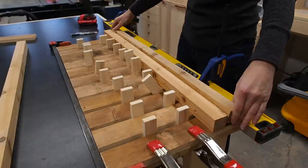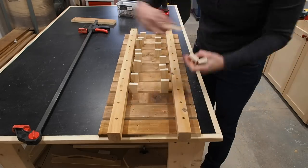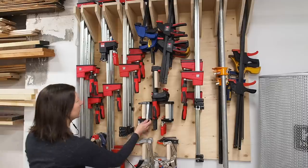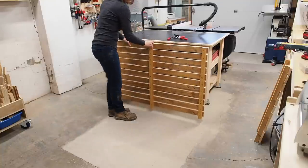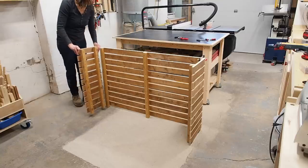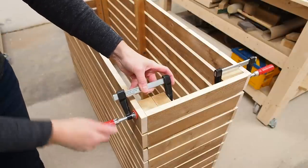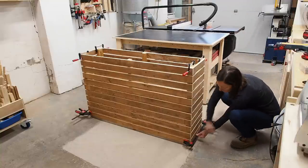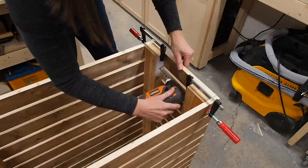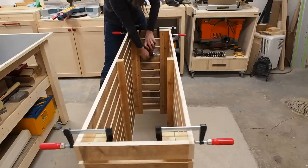Alright, with that done I can assemble the two remaining panels. Once all four panels are assembled, the planter should come together like a puzzle — just be sure to have a few clamps on hand. I'll use one clamp to secure each of the four corners, making sure the top edges are flush with each other. I'll then use a couple longer clamps to squeeze the bottoms together. It's a tight space to get these screws in, but it helps to drive them at an angle, and also helps to use a compact driver. I'll leave a link to this and all the tools I use down in the description below.